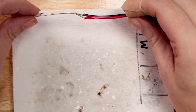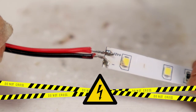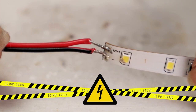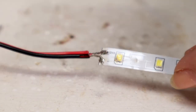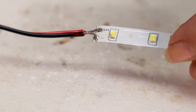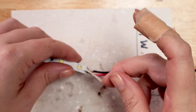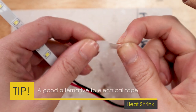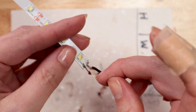After your piece is cooled off, you can pick it up off the board. These two wires, if they were to twist together and have electricity running through them, then you could get a spark, it would short out, could cause the fire like I was talking about. You need to keep the exposed wire away from each other. So I've taken a little bit of the electrical tape, just a piece right here, and I'm going to sandwich it in between these two wires. I've cut a tiny slit in this and I'm just going to slide it in between my wires